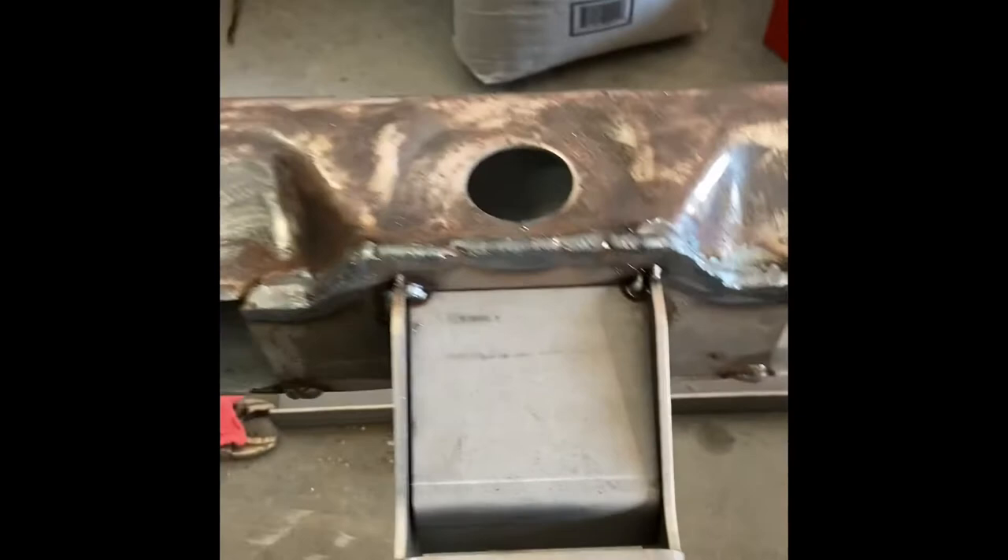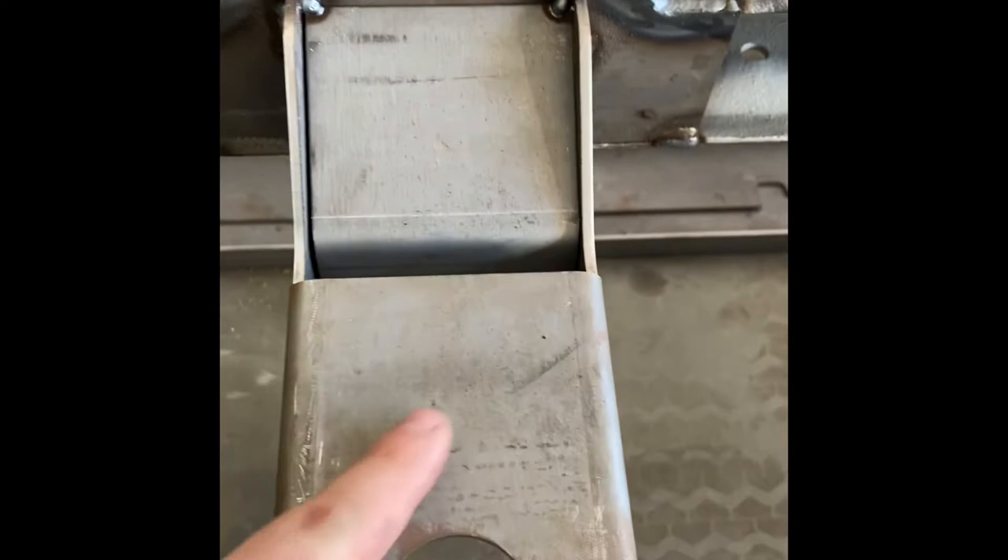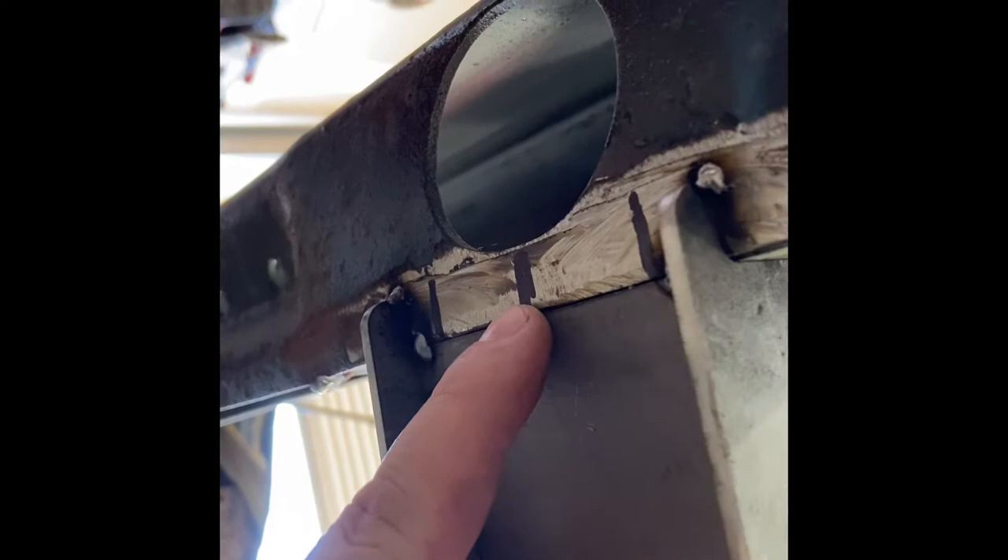You put this piece on — it says just weld a little three-quarter inch bead there and a little three-quarter inch bead here. I've tacked it on the top and the bottom. What I did was measure from this hole, took the width of this, centered it, made my reference mark from the bottom side here. I measured half the width, made two witness marks, and made sure these two flanges lined up with the holes in the seat, then tacked it into place and measured to verify.